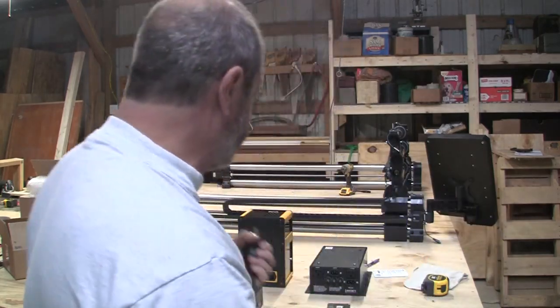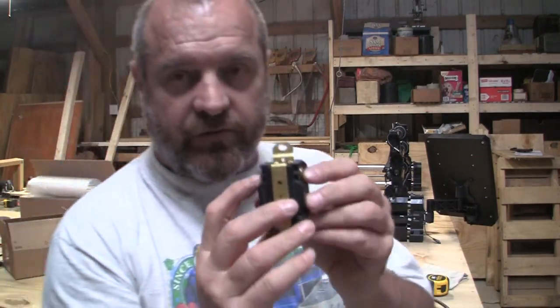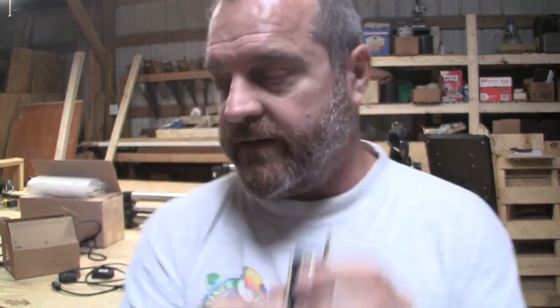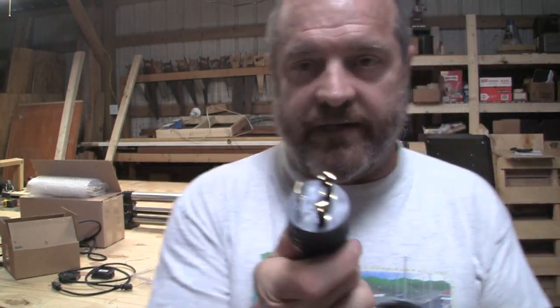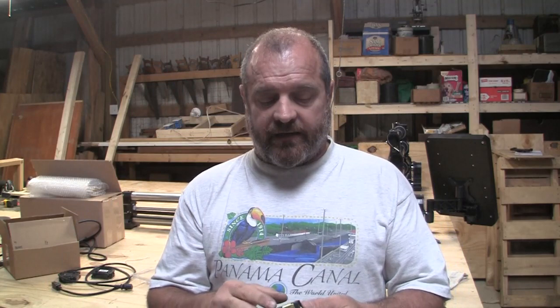Okay? Now, why is this going to be a 12.2 cable and not a 12.3 cable? Well, the reason is there's only two legs on it. You got these two legs, and you got the ground down here at the bottom. As you can see, if it would have been a 12.3, I'd have one wire I can't really connect anything. We just have two legs going and a ground.